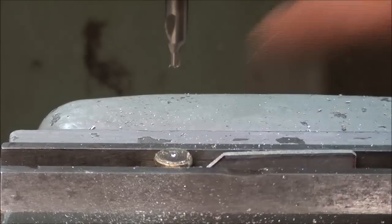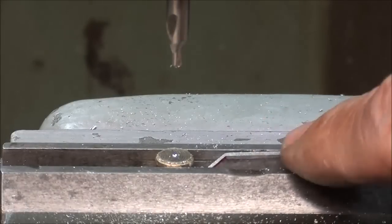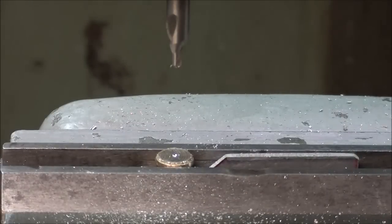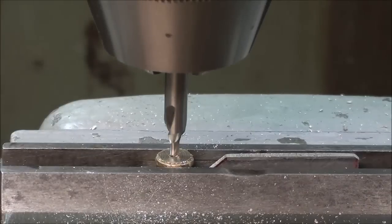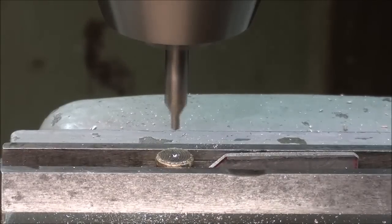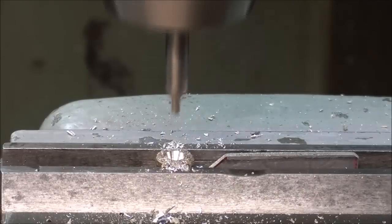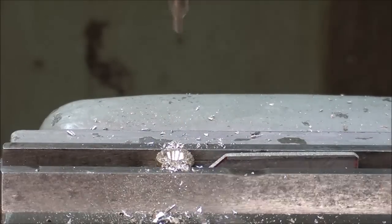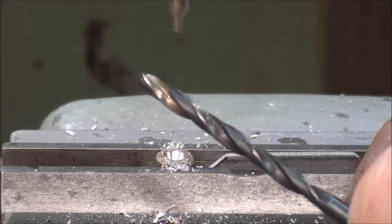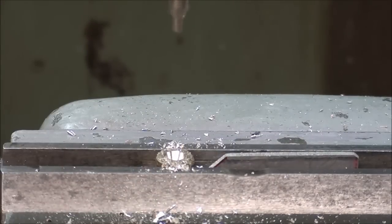This is the 45-degree L, and you can only see the top of it here, but it's held on a little 45-degree angle gauge that I made. I'll show you that in a minute. I got a little bit ahead of myself to assure that it's at 45 degrees. I've already milled off just a little bit off the top, found the center, and I'm ready to center drill right now. Now I will drill it this size, but I probably have to drill not quite as deep as usual or I might go through the side wall of the casting. Then I'll go ahead and tap it, but I won't show that — I'll bring it over to the bench and show you how I'm going to do the second side.